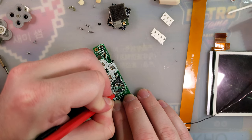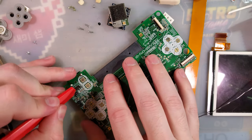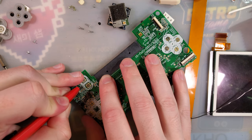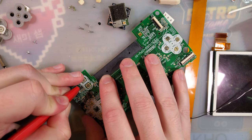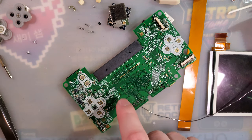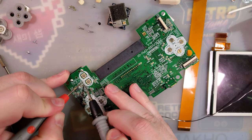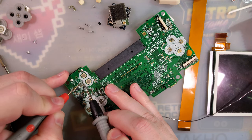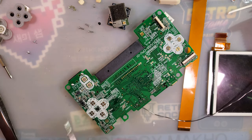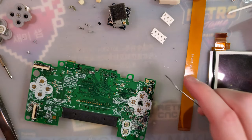I'm just terrified of slipping. Try going this way. We gotta be especially careful because these are 6-layer boards, I think. So if you cut too deep, you can cut into power, but there we go. We are good. All right, with those two cut,